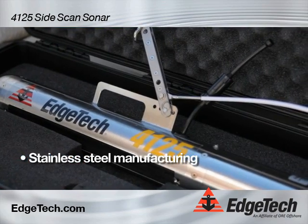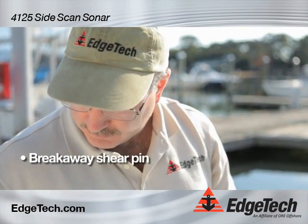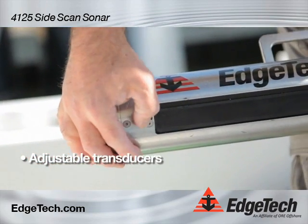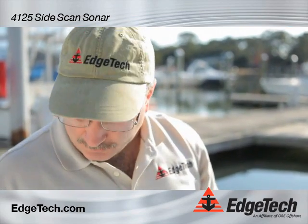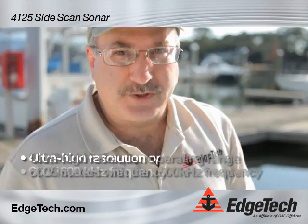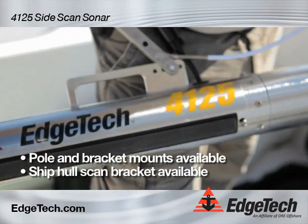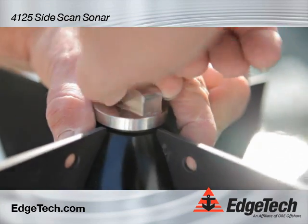It comes manufactured of all stainless steel for low maintenance. It has a breakaway shear pin — in the event that the towfish strikes something on the bottom, it'll break the shear pin and tow from the back to get it off a snag. The transducers are adjustable for shallow water operation. It also comes with a heading, pitch, and roll sensor and a depth sensor so the operator can know the attitude of the towfish. Frequency sets are 400 and 900 kilohertz, and 600 and 1.6 megahertz. The 1.6 megahertz would be the ultra-high resolution for search and recovery operations. It also comes in a pole mount option for bulkhead scans and hull scans, or a hull scan bracket for strictly hull scans. The tail fins are attached to the tail cone with a thumb screw and the towfish assembly is now complete.